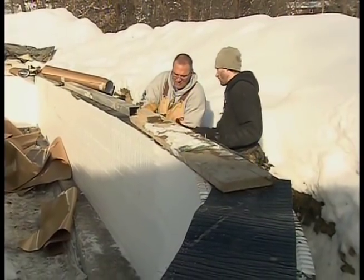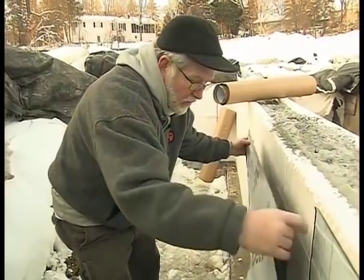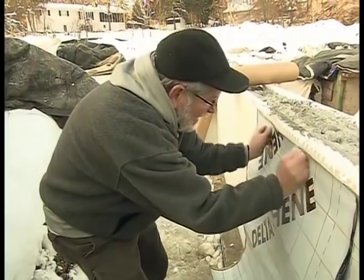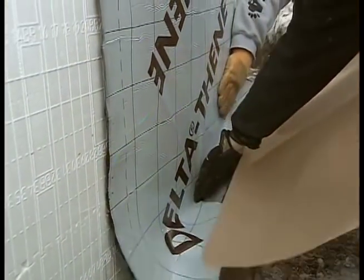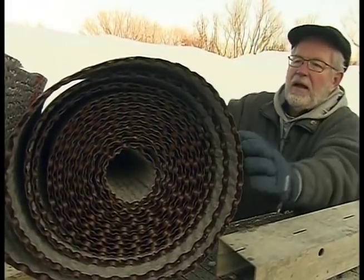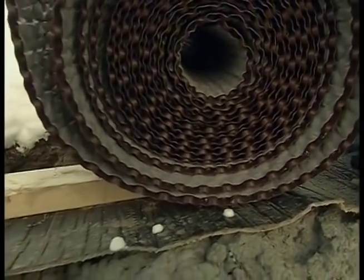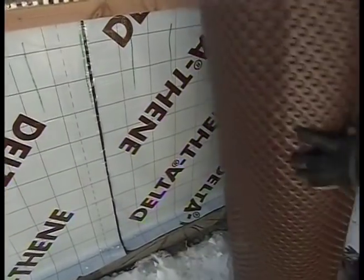When we look back at that project it is so totally dry — it's just wonderful. So we're going all around the house with our first layer of protection, and once our peel-and-stick is completely surrounding the house we'll come back and work on our second layer of defense. The second layer is this dimple wall that we place over the top of the peel-and-stick material. These dimples — this part here — go up against the wall.